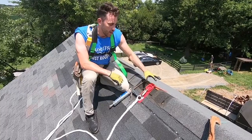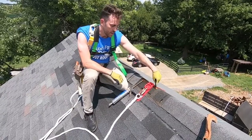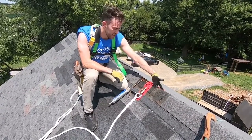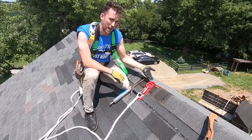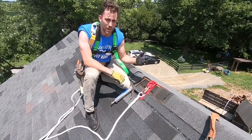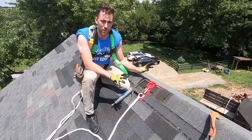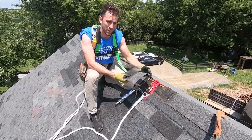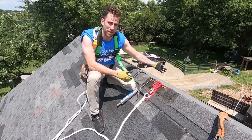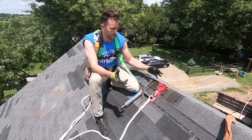Make sure you have baffles in your attic and make sure it's vented if that's the type of ventilation system you have. I opened up the roof to secure my anchor and this opening goes to the attic space — I can feel hot air coming out when I put my hand over top of it. The reason is there's a lot of hot air trapped in there due to the fact that the roof isn't venting. There's no ridge vent — all I had was caps — and at the bottom there are vents allowing air into the attic space, but it has nowhere to escape.